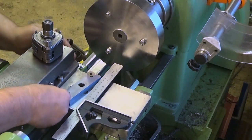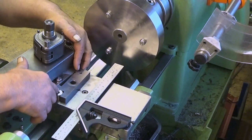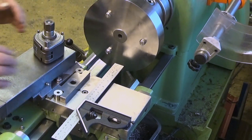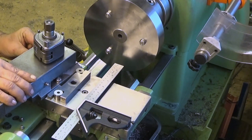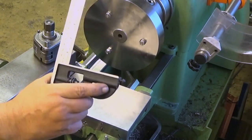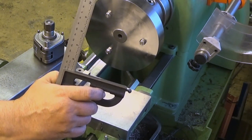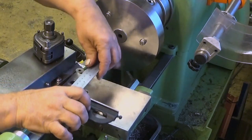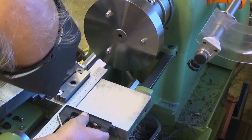So, I put the gauge block here under, and then use this sine bar. This sine bar has a distance between the round things of 100 millimeters. So, I approximate here about 7 degrees, so it should be somewhere there. And then I use my combination square. I have noticed that this is actually really square. I can check it out by measuring two ways. I'll show you when I do this. So now when I put this here, we should get...